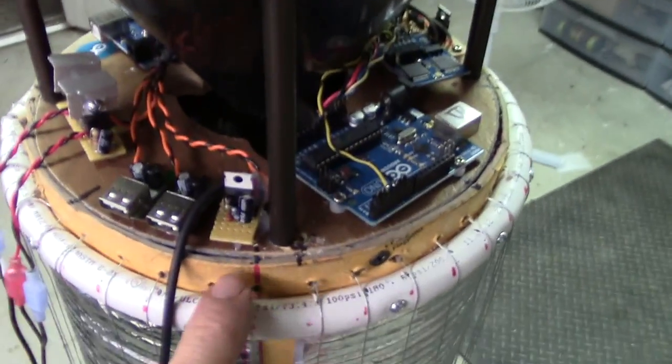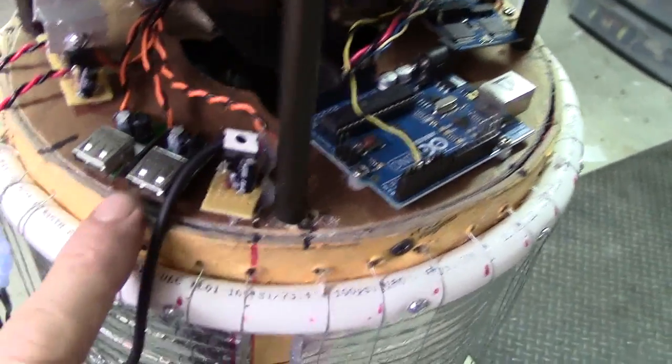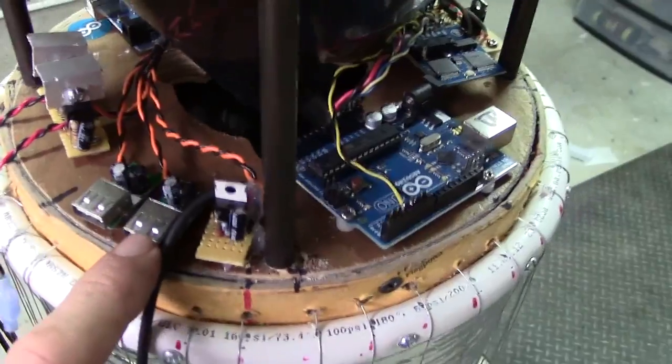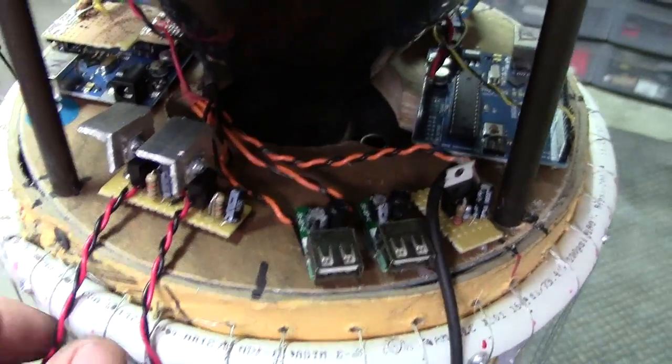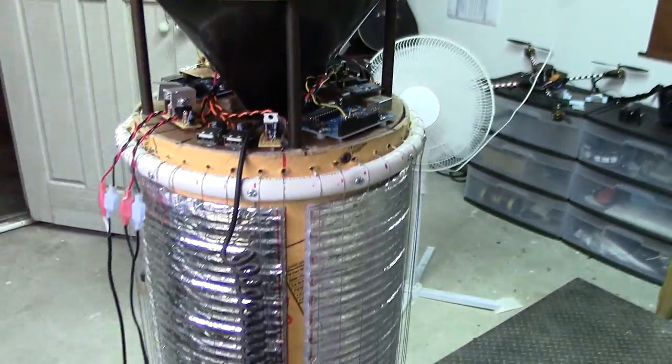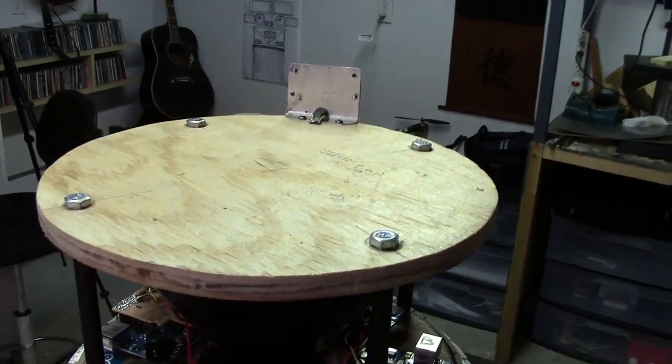Okay, we got progress happening. Here's the GoPro voltage regulator, 3.2 volts. There's my two 5 volt power supplies. Here's the other two voltage regulators that output 5.2 volts each. All that stuff is on board now with wires. I've got a really cool stretchy cable for the GoPro because it's going to go way up on the top of a boom. Now it's down to just the hardware on the top here to mount the cameras. Got to get going on that.